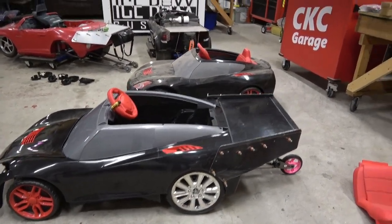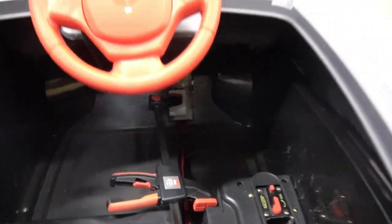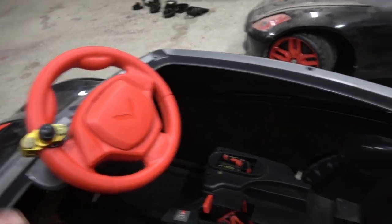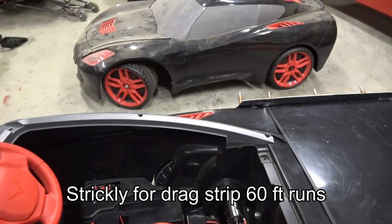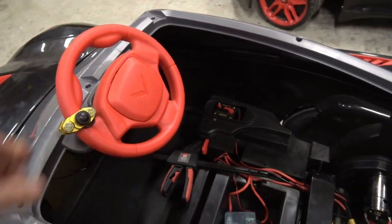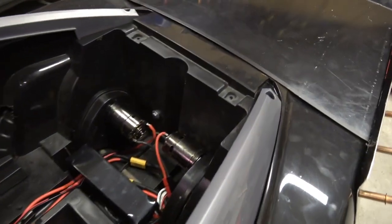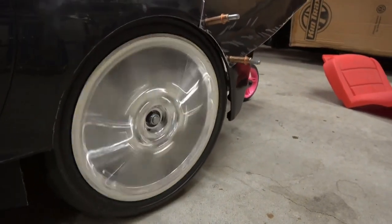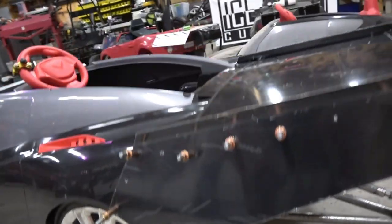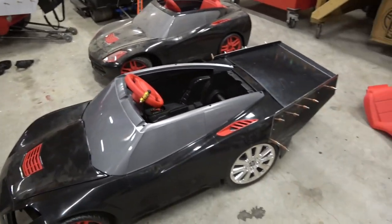Here's a better view of the car off the work table. We're temporarily using a clamp pressing down on the gas pedal with the battery plugged in. The car is staged — it has no reverse and no brakes, keeping it simple. Power comes in, you press the button on the steering wheel, it closes the normally open contact on the relay and sends power to the motors. We've also really lowered the wheelie bar so it's holding the rear tires off the ground during this bench demo.